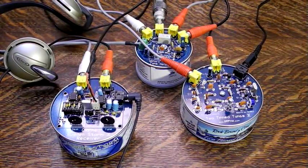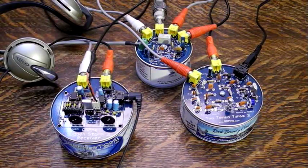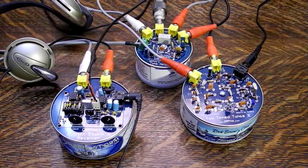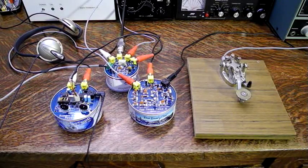If you're ready to get on the air, you can replace the dummy load with your antenna or antenna tuner. If band conditions are good, you should hear some signals in the receiver. If you use an antenna tuner, use it as you normally would. Some automatic tuners may not work with such a low power level. A manual tuner may also be difficult to read SWR unless you have a low power setting or use a QRP watt meter. Here you can see my antenna tuner with negligible reflected power after adjusting it. Listen for a CQ and answer it, or if the frequency is clear, call CQ. With the Tuna Helper, you have nice break-in operation that even some bigger rigs lack.